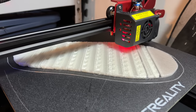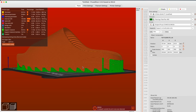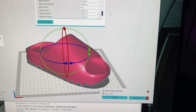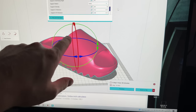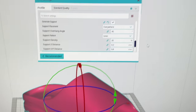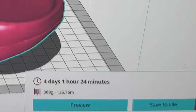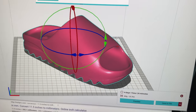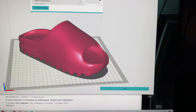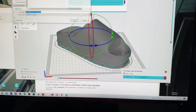So what I decided to do is print two more pairs — one on the Creality CR10 Pro V2 in a really cool glow-in-the-dark Ninja Flex filament, and one on the Prusa where I was able to make it slightly larger at a different angle, this time all in gray. I'm trying to slice these on the Creality Slicer. The problem I ran into last time was a lot of stringiness underneath the inside of the shoe. I'm considering adding support material under there, but it increases build time by a whole day. After weighing it, I decided to add the support because I want the shoe to be wearable and look good — so we're looking at five days and two hours. Let's save the files and try this again.